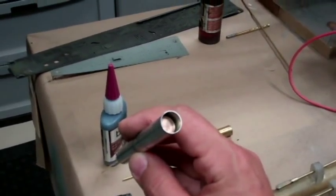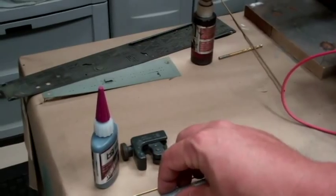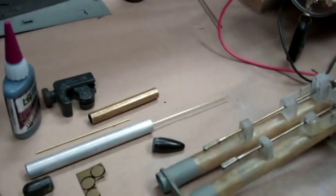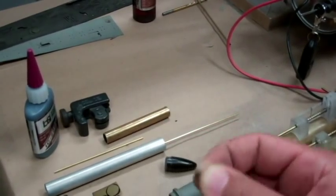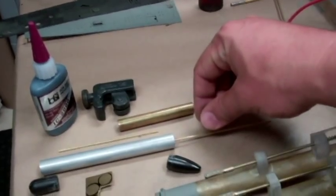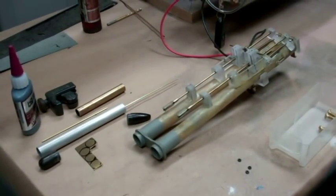I've got it installed inside the body of the torpedo, adhered with rubber-reinforced CA glue. We've got a self-contained pressure vessel with only one inlet and outlet at the back, which will serve as both the discharge nozzle and filling nozzle. These are very tiny 1/16-inch o-rings, and I'm going to make a compression fitting in the back that you can tighten or loosen for a nice tight fit. To launch the torpedo, you simply pull that breech off the back and the torpedo goes flying forwards.